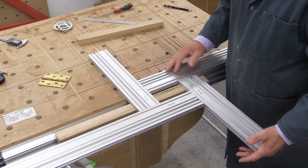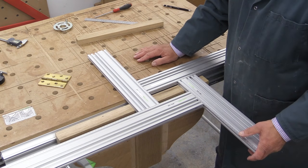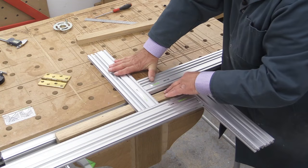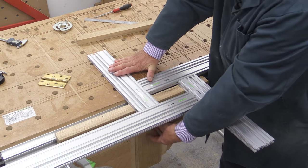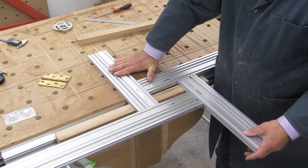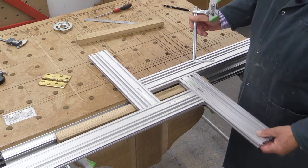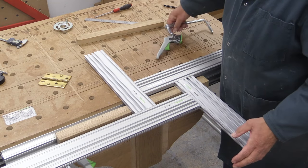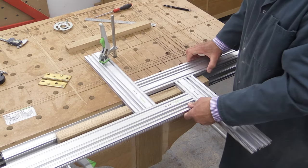When it comes to sorting out left and right, you can have your own scheme. The next issue is how do we attach this to the workpiece? I've got the luxury of a bench here so I could just clamp this in place, and the workpiece is already clamped to the bench. You could use these brackets in some way if you're able to clamp from underneath, but if this is a full door it starts to get awkward. So you need to think about clamping strategies. These Festool clamps will fit in a number of different places in the track, but they might not necessarily help you with the door.